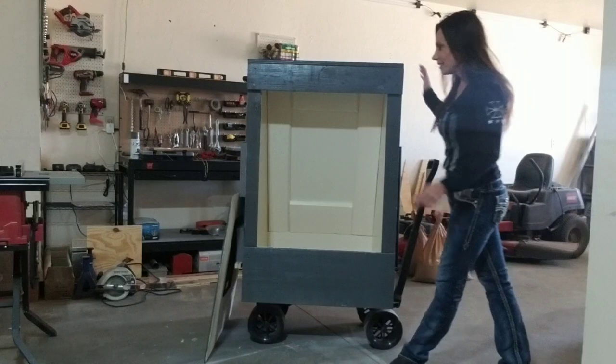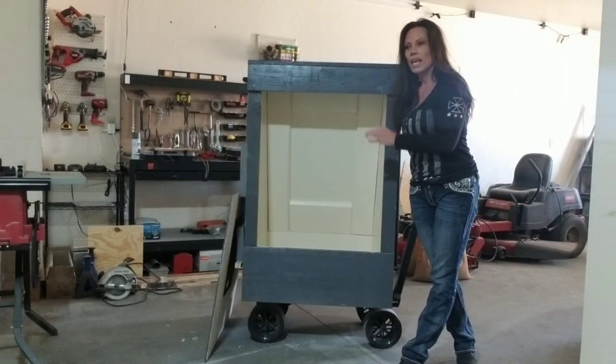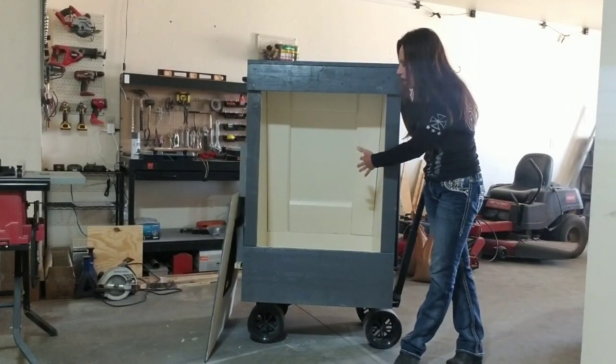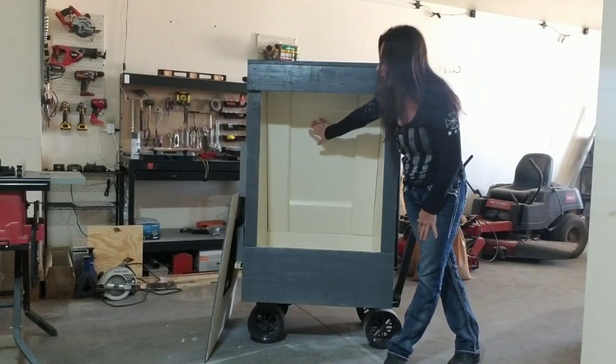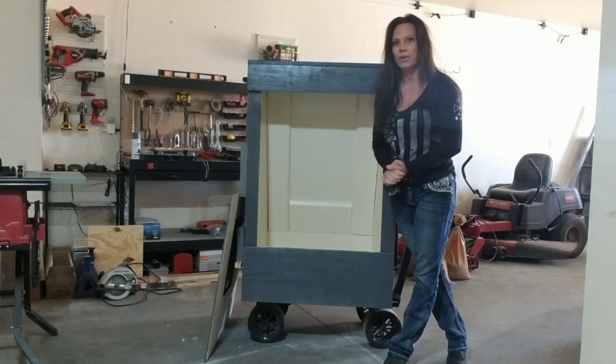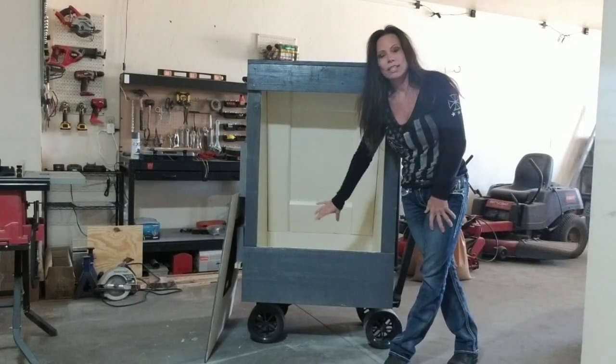On the inside is my piece of steel — it's AR500 steel, 3/8 inch thick, 18 inches across and 24 inches tall. It's angled forward at a 20-degree angle to hopefully help prevent ricochets or direct any ricochets straight down to the ground.